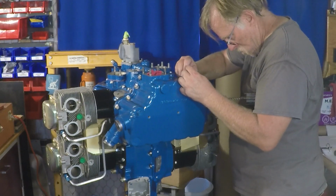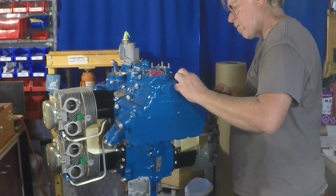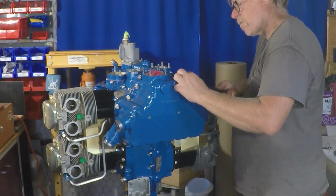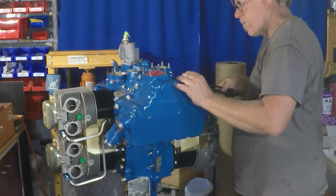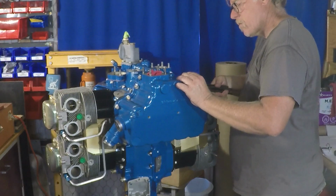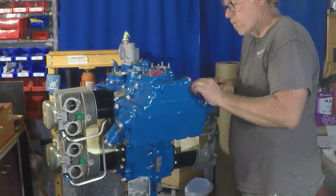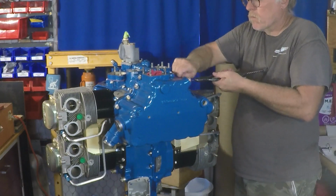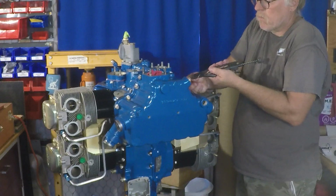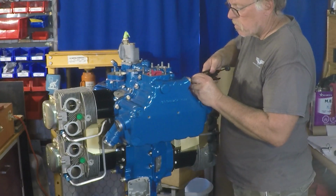Most importantly, especially for any of you owner operators, it doesn't have to be perfect. Don't get hung up on that. In our mechanic schools, a lot of the instructors like to just harp on the fact that safety wire has to be perfect. Safety wire is not holding the aircraft together. Its whole purpose is to retain the part until you find the problem, and then you can hopefully fix the problem, but the safety wire retains the part.